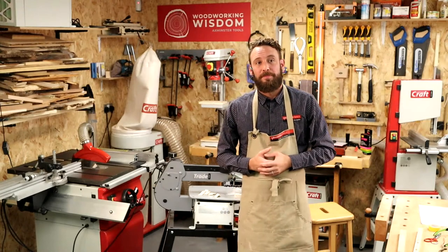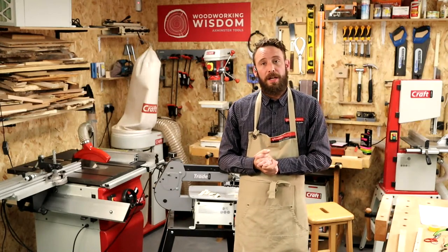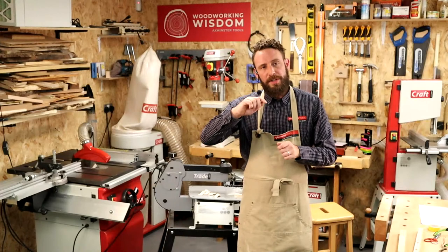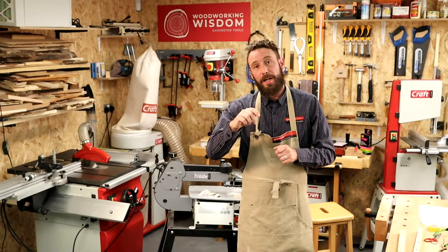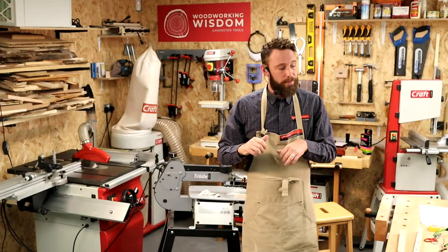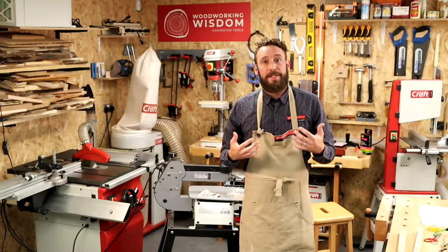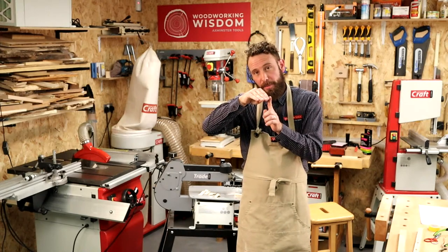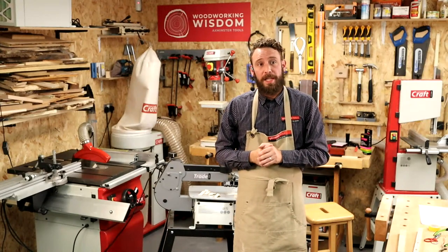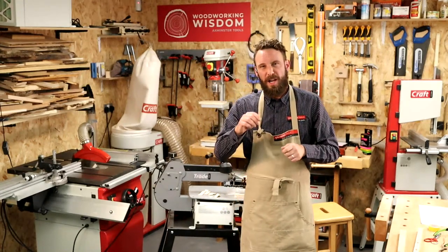Paul's asking whether using a marking knife would help — would the blade follow that mark? Potentially, but I've never really used a marking knife for this. There are quite a lot of curves going on and sometimes as you twist to carve with a marking knife, it could just throw the tip out because it's twisting in the grain. It's great for sharp, clean, straight lines and marking off square, but something more intricate like this can be a little bit fiddly.